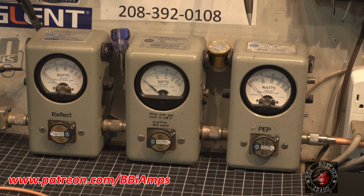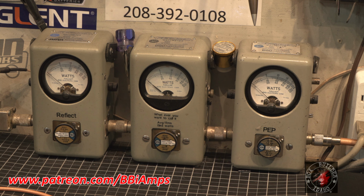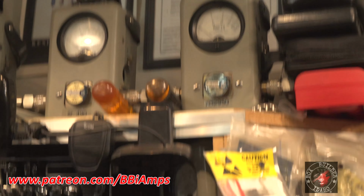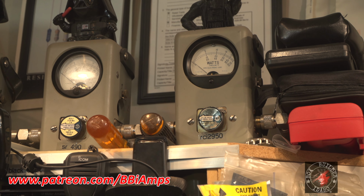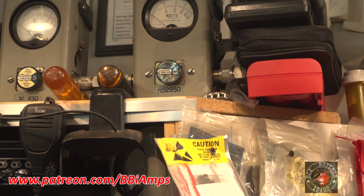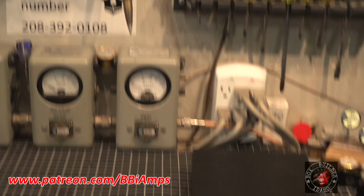And we're going to put about 20 watts or so into it, give or take. Amp on. 400 watts, no problem on 12 volts. Let's turn the volume up on the radio. Preamp works great. Our input tune is good. Awesome. And we'll turn the amp off. Our pass-through tune is good. Awesome as well.